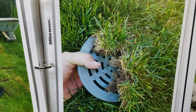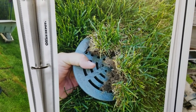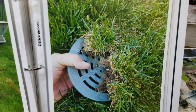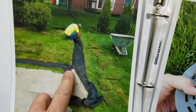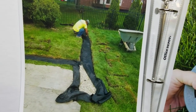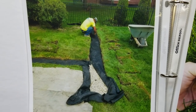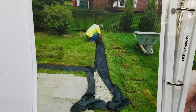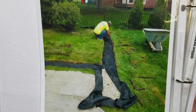Here's another issue with inlets: you've got to keep the grass cut because it grows right over them very quickly. You have to be vigilant. These are things you just never hear guys talking about. But our systems aren't built with inlets — this sod will go right back over this system. All the dirt's been hauled away; we're not putting the dirt back. We just took the sod off with two and a half inches of root — it'll grow over the French drain no problem.